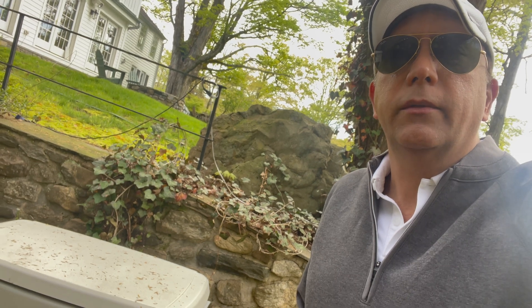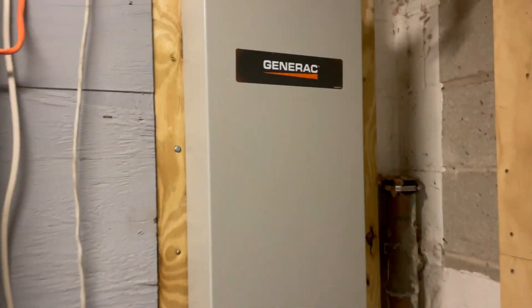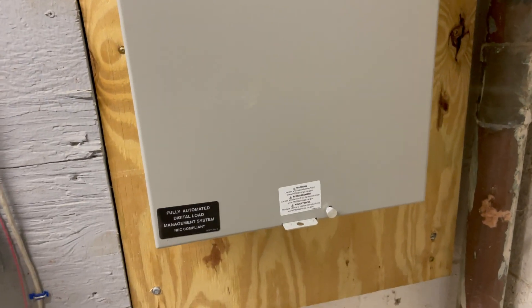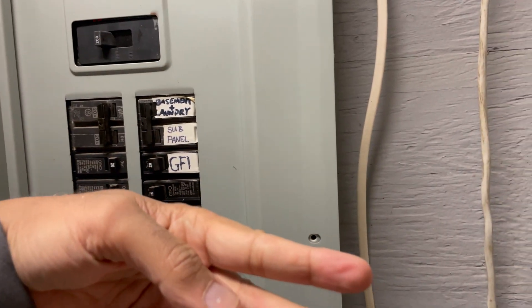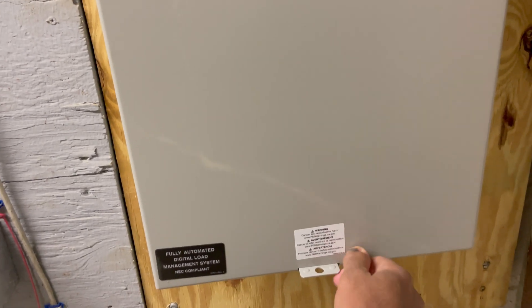Many of you have asked us how to do this, so I'm going to show you. Let's go into the transfer panel. This should be a similar configuration to what you have — your main electrical panel and the generator automatic transfer switch for a whole-house system. This is a whole-house test. If you have an essential circuit setup, you're going to have a double breaker in your circuit box that goes to the generator panel — flicking that will simulate lost power.